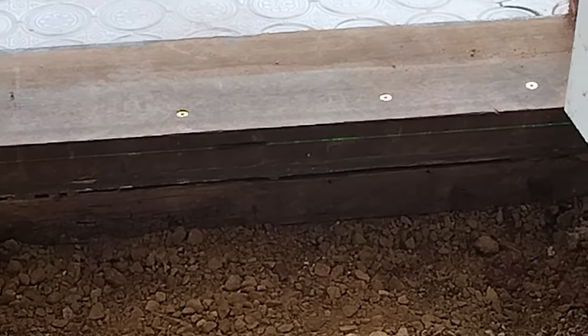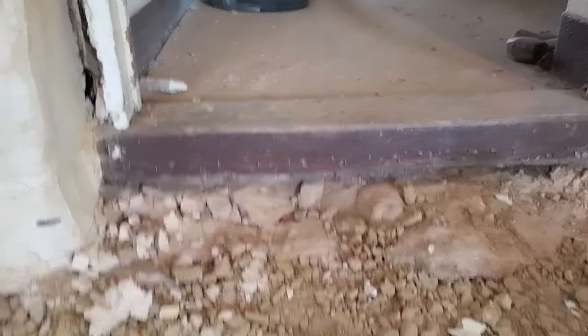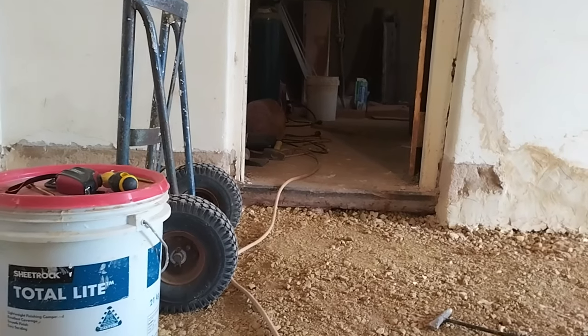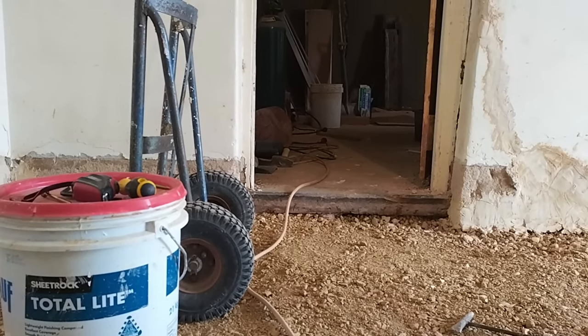See that green line down there? It's where the concrete's going to come up to. And on this doorstep here, it's going to come up to the bottom of the step there. It's going to hit just here. And on that doorstep over there, it's going to have the same sort of gap as the front door, probably 10 mil before the top of the door.